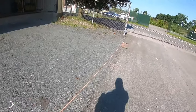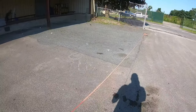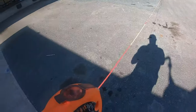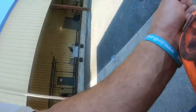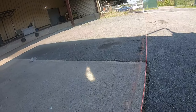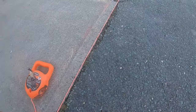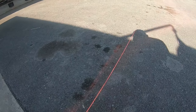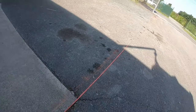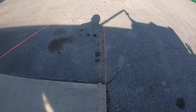All right guys, first thing I'm gonna do, I drove a pin down in there. I'm gonna get a range back to this existing piece of concrete. And when we first saw cut that last year, we ranged this to get that saw cut. So right about there. Hold it with my foot, snap that, and then we will saw cut. Perfect.